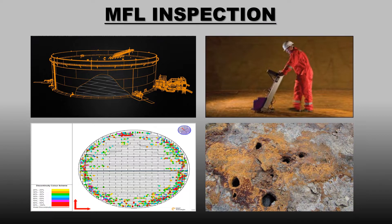Magnetic Flux Leakage or MFL technique is widely used for non-destructive testing for detection and evaluation of surface and subsurface defects in ferromagnetic objects such as oil and gas pipelines, storage tank floors and wire ropes. This technique detects gaps, cracks, corrosions and flaws by the help of the magnetic field supplied by a current source.